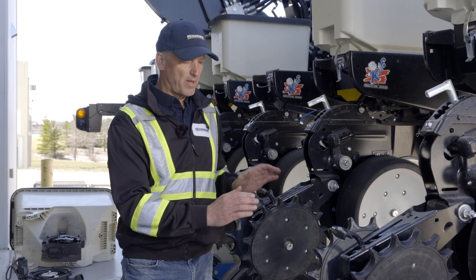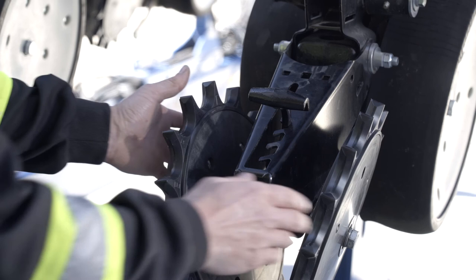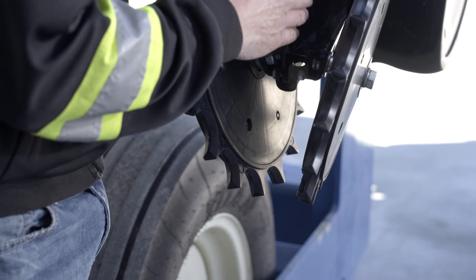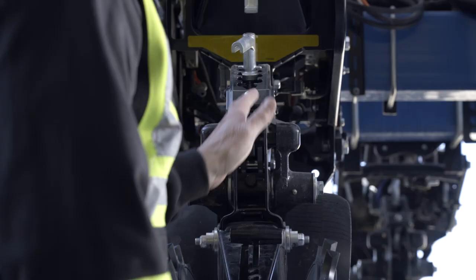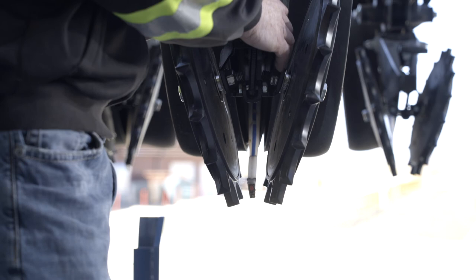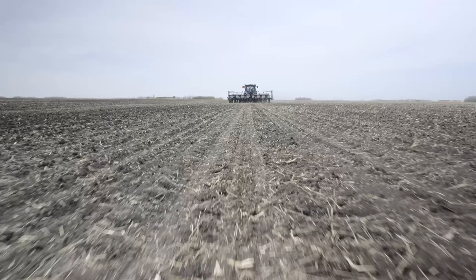Check your closing wheel spacing and clearance — there should be roughly an inch and a quarter between the spikes on your closing wheels, and they should all be the same. If not, you can shim and adjust them. If your disc isn't lined up or your row units are worn, they'll pull to one side and your closing wheel will run off-center in the furrow. Making sure your seed is at the correct depth and your closing wheels are doing their job is critical — you have one shot at planting, and if everything isn't working correctly, you're already decreasing yield.